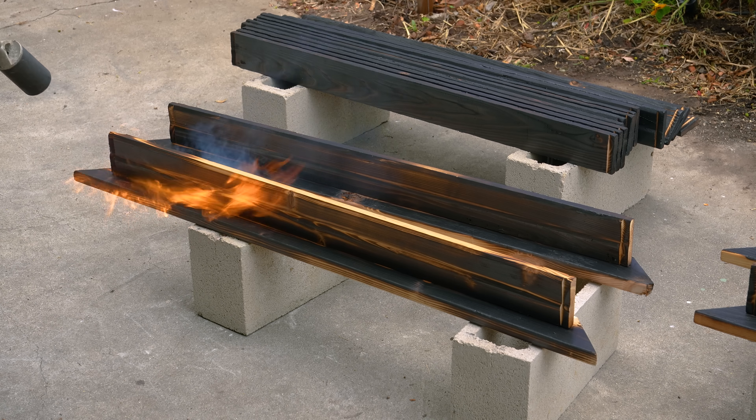Now that all the wood burning is done we can move on to the next step, which is to prep the surface. Here's one I just finished - we're going from this fully burnt board to this look. It's almost like a coffee stain. I recommend getting a wire brush that either fits in your palm or a short handle one. You're going from char to this, and when you brush it and no more major stuff is coming off, that's when you're finished with the brushing process. Now I'll finish brushing all these boards and then we're going to hose them off.